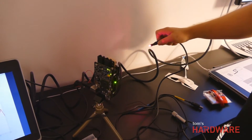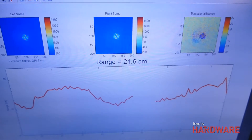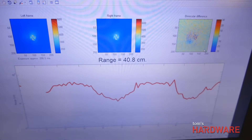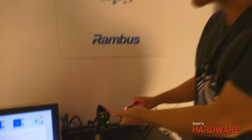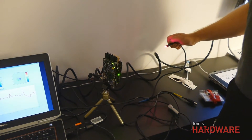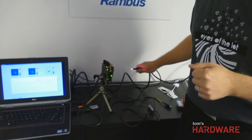As I move it back and forth, you can see that the range changes. What's remarkable is that because the point spread function has so much texture, it's much easier to align two spirals together than to align two points together — giving much higher accuracy in range finding for a given baseline than you would get with a focusing camera. In fact, if your human eyes had the same kind of accuracy, you would be able to have accurate depth perception of objects approximately 15 meters away. We get high accuracy depth perception out to a range of approximately 300 times baseline, which as far as we know might be best in class. So we have the same optical system producing low-fidelity images, yet it can do high-fidelity measurement because of the specifics of the optics involved.